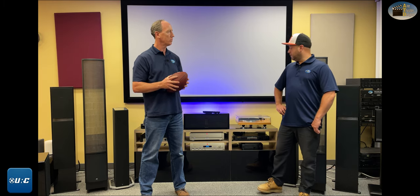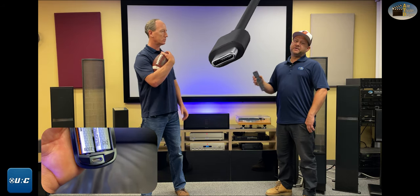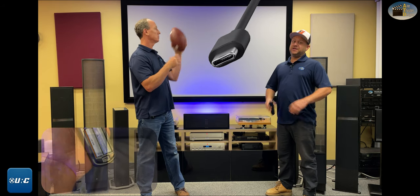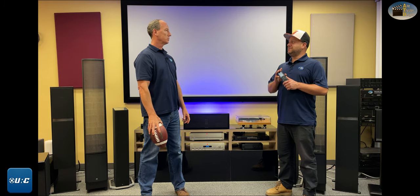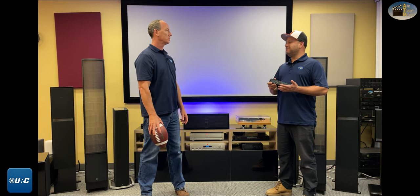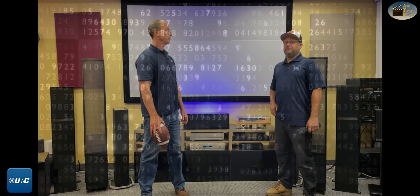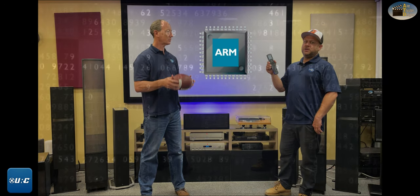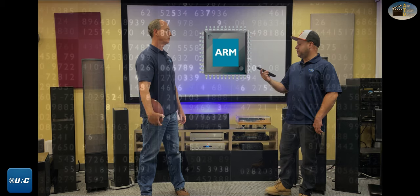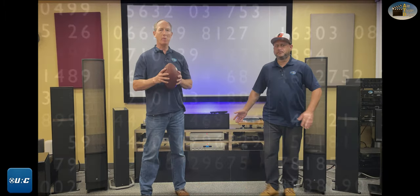For the tech geeks: it's got USB Type-C. In our download time battle test, it took about 54 seconds. The old MX 780 used USB to USB Mini — pretty dated by today's standards — and that took about two minutes and 20 seconds. So you're cutting it to less than half the time, making it more efficient for integrators, installers, and programmers. It's also got an ARM microprocessor chipset, similar to what your iPhone and smartphones use, so this thing should handle all our programming well.